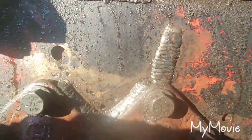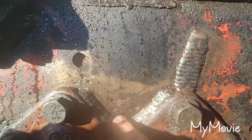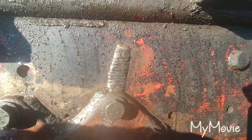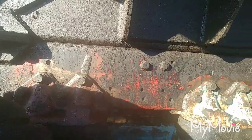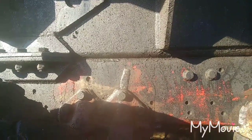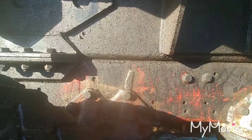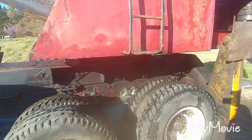I don't know how well the camera picks it up, but there's a bunch of spider web cracks everywhere, and all the way down the weld here. I'm sure there's a lot more. I think it's because they welded these on — I have no idea why. That crack starts right at the end of the weld. When I get to that point, I'll take it to a fab shop and see if they can grind it out and weld it up. If not, maybe I'll do it myself if I get my hands on a nice DC stick welder with some 7018.